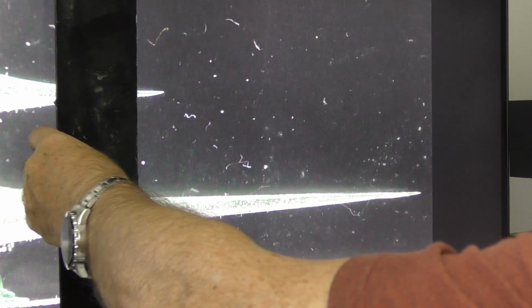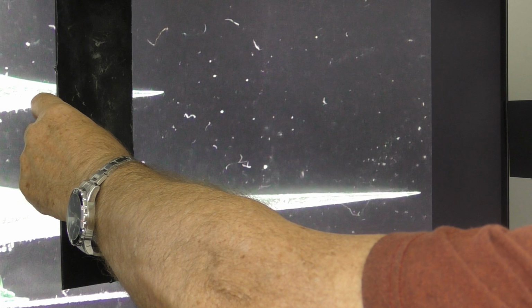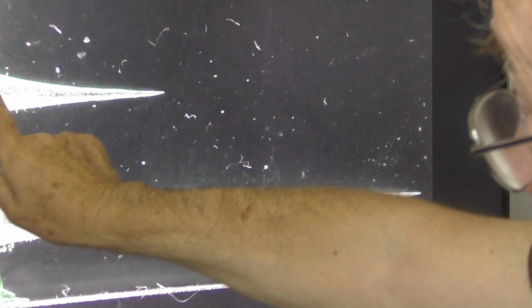Now, this is 15% power. The shape of the beam never changes. Given a little bit more exposure time, 15%, 100%, if we change this 15% to say 10%, we would get this. 5%, we would get this. 2%, we'd get that. The beam shape does not change. What changes as you change the power? Look at the diameter of the damage. The dot size that we're producing on this machine is controllable by the exposure time. So if my dots are too big, I reduce the power. And in reducing the power, I can decrease the dot size. So there's a big difference between these two technologies.